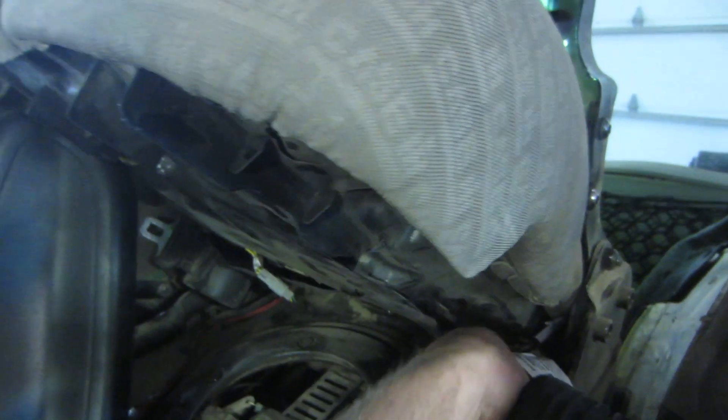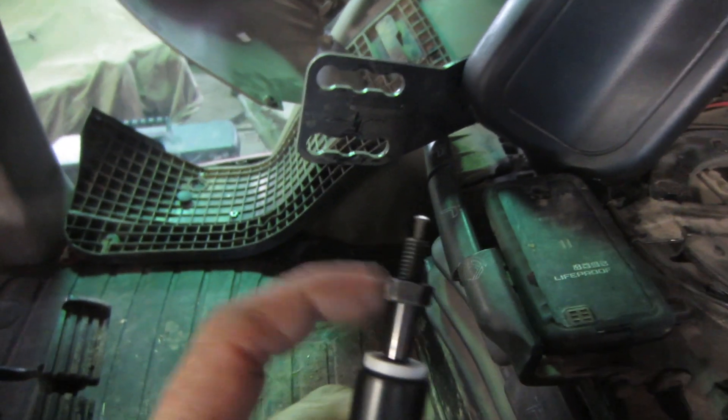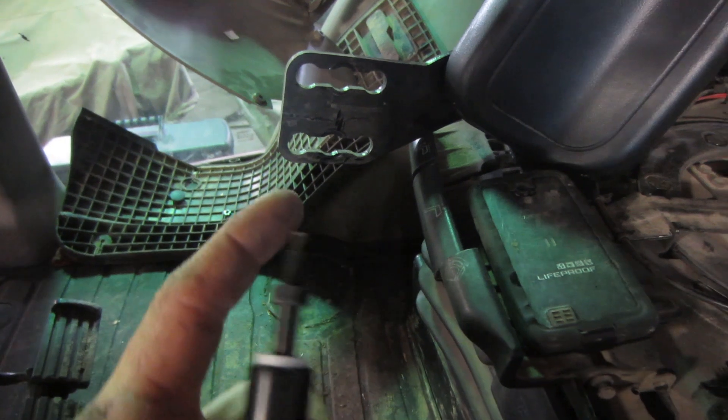How that works is this little rod here, which has a clip on the back and screws into that little actuating block. Before you replace anything or send it anywhere, you can just lift up on the seat cushion, which is only held in with a couple of tabs on the front. You can then pull this rod out to make sure it's working, and stick it in a vise with the lock nut in the vise.